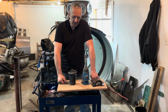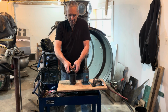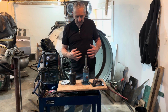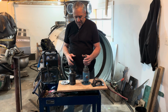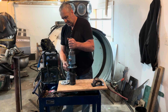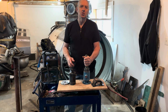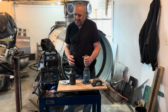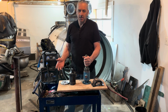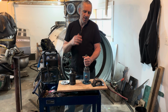And when I was doing that, I was nervous that it was going to leak, because this motor assembly was designed by me, the whole assembly, in my design. I simply planned on this dropping over this and then a gasket here with some silicone. Should work just fine. But I hate gaskets. And I hate silicone. Anytime you want to remove the motor, you've got to get rid of the silicone, the gasket, scrape it, clean it, blah, blah, blah.